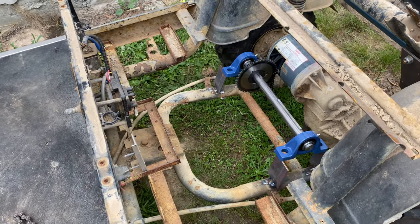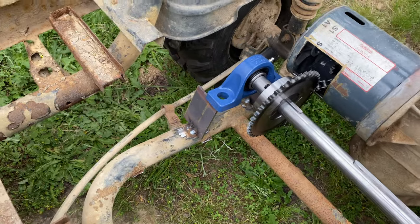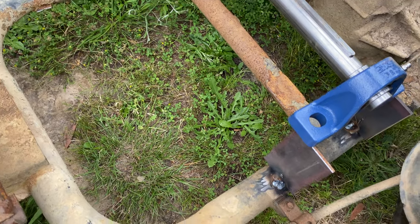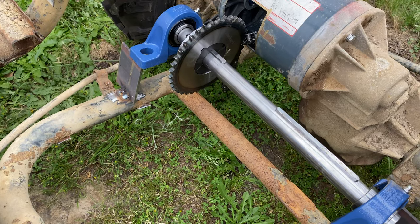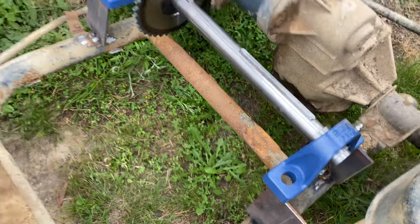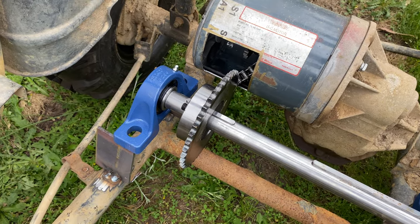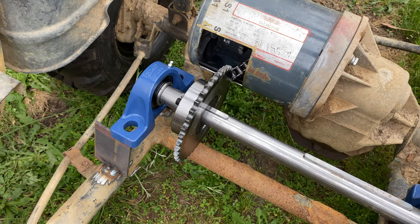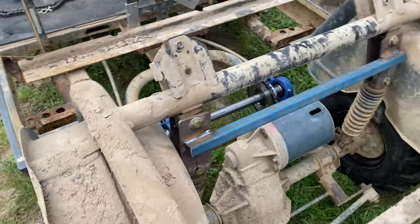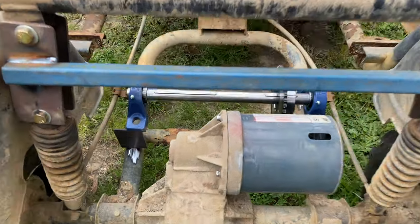I've got this thing pushed back outside. I'm really happy with how this turned out. So the sprocket isn't lined up at the moment — I've just set this on top. I've just tacked these plates in place because I don't know if I'm going to have to move it once I put the motor in. I will have to run a piece across the top with slotted holes so that you can adjust the chain tension. The plate I'll probably make fairly big so we can bolt it wherever, because my shaft is probably not long enough to fit on both sides. I did want to put it all on the swing arm so it all moves as one. I'll have to cut some more out of that motor once I've got it mounted — I probably should have cut that after instead of cutting it before. But that looks pretty good down in there, the chain is thrown inside, and I'm really happy with how this back turned out. It's all braced up now and it won't go anywhere. I will add some more to those front A-arm plates that I did make, but for now that's going to be really good.